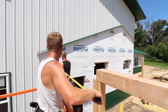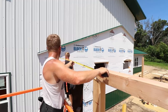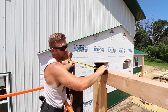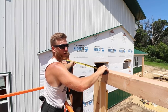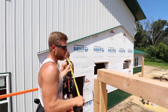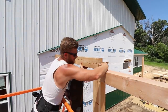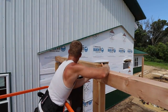Bump me right into that line there. Give me a second. Sorry, I'm just impatient. All right, so this is why we wait, because it's close, but we're an eighth inch from being perfectly plumb on our main wall. So we're gonna cut this one at 95 and 7/8, not a full 8 foot. Like that. Might have to come in at the same time. Does that go up? Go up a little higher, Zach. Keep coming. There we go.